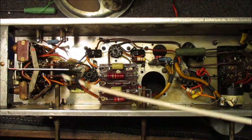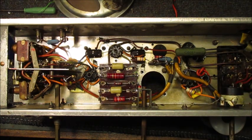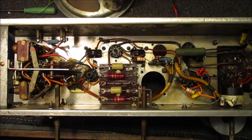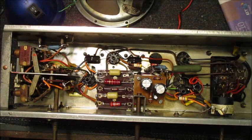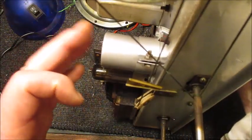The two capacitors and four resistors have been checked and replacements fitted where required. Now I'll refit the old dual electrolytic capacitor canister along with the printed board I knocked up. At long last, this printed board is now secure on this chassis - each one of its connection wires soldered onto their correct tags - and I've reinstalled the old dual electrolytic capacitor canister.